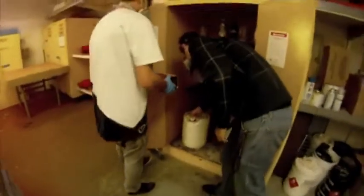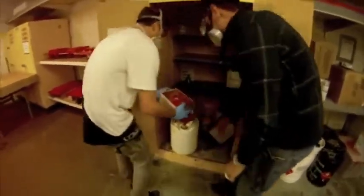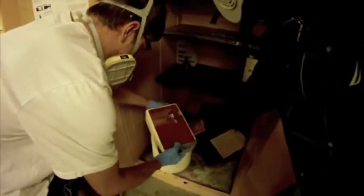Once the gun has been thoroughly cleaned, take the first acetone bath and pour it into the waste container located in the flammables cabinet. It is a good idea to have another individual with you to hold the funnel to avoid any spills.